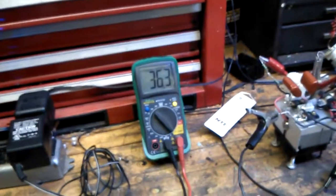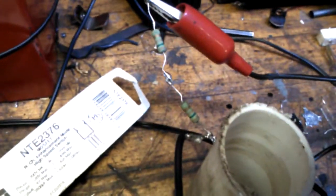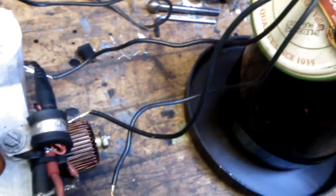Powering on — power supply dropped to about 17 volts. My DIY oscilloscope is just tied across the coil, like in some of the other YouTube videos, so it doesn't read like a regular scope and has no adjustment. I've got resistors across the capacitor with two taps into it, and it gives a nice little signal that you guys can see. Here we go — 36 volts in.